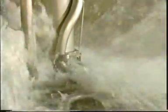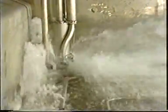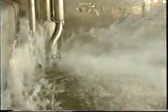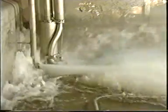Also, when using a separate drop line, as we have on this ship, we recommend to start loading slowly through the pump only, until the level is above the drop line outlet, or after the so-called 1-foot sample is taken. We normally recommend to open up the drop line valve and continue loading through both the pump and the drop line.